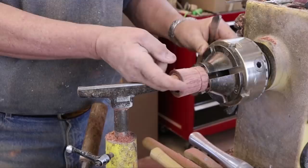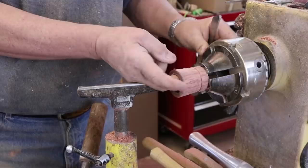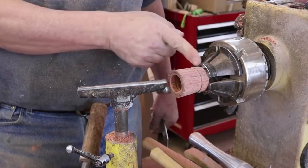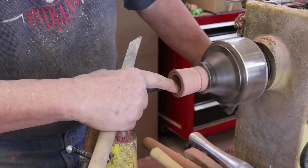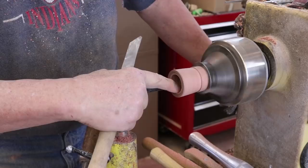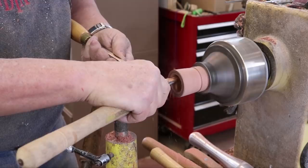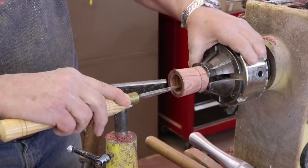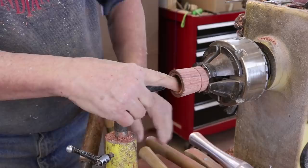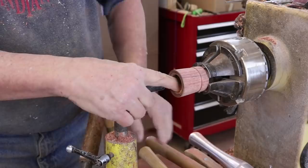Now that's going to fit right like that. This is the top of my box; this is the bottom; this is the threaded area. I'm at a point where I want to hollow this out. I've got an old gouge reground with a very long wing on the left side. I've got a hole drilled down to my final depth up here. So I'm going to do a little bit of work with this gouge and hollow this out. I've got this part of my box hollowed out. I'm going to mark this very precisely for the depth, and I'm ready to chase some threads. I'll level off this surface at the very front and make sure it's as parallel as possible. With my recess tool I established that recess or stop gap, and I've got a chamfer on the front. I'm not sure how this Burmese rosewood is going to take a thread — we shall see.